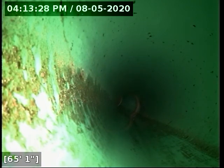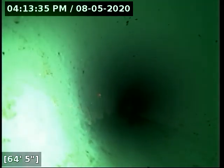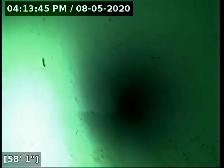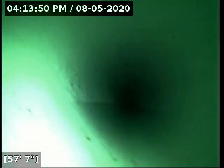What I would do, though, if your home comes with a warranty anyway, is rescope the sewer line just before the warranty runs out to ensure that the line has not settled anymore. Generally, bellying and settling is not progressive. Usually it happens almost instantaneously after the line's been buried. But I have seen lines settle in that first year or so, just because they're so new the ground can still be shifting.